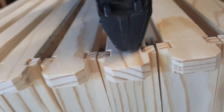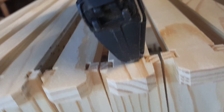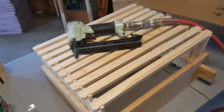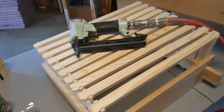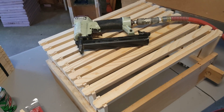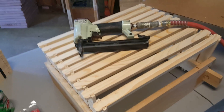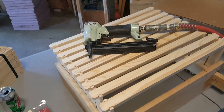...perpendicular to the end bar, it makes it pretty weak. Whereas if you just tip it a little bit and fire that staple in at an angle, then that frame is constrained on all sides. The notches in the end bar and the top bar, and the fact that the staple is in at an angle, makes a stronger frame.